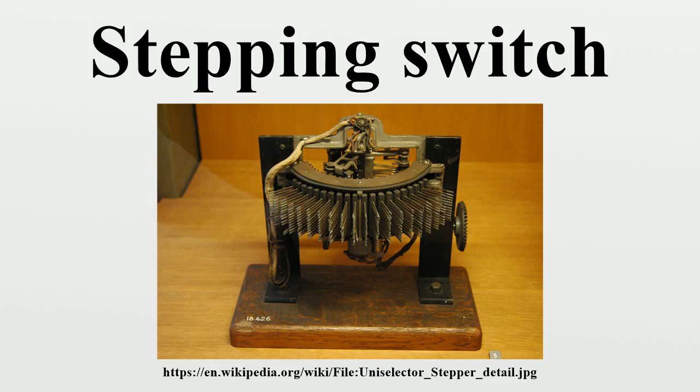These were commonly used in telephone switching with 10 banks of 10 contacts. The coils were typically driven by electrical pulses derived from a rotary telephone dial. On a two-motion selector, as a digit was dialed, the wipers would step up the banks, then automatically rotate into the selected bank until they found an unused outlet to the next switch stage. The last two digits dialed would operate the connector switch: the second-to-last digit caused the wipers to move up and the last digit caused them to rotate into the bank to the called customer's line outlet. If the line was idle, ringing voltage would be applied to the called line and ringing tone sent to the calling line. Another variant was the Stromberg-Carlson XY switch, common in telephone exchanges in the Western USA. It was a flat mechanism where the moving contacts moved both sideways as well as to and fro, and could be maintained by people with minimal training.